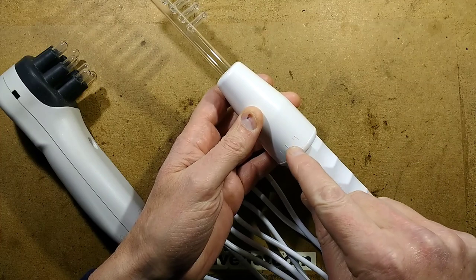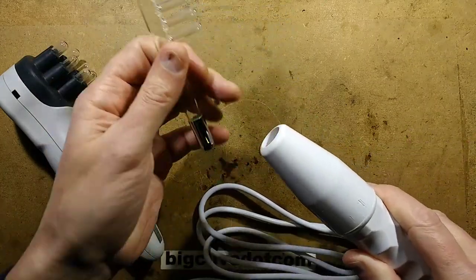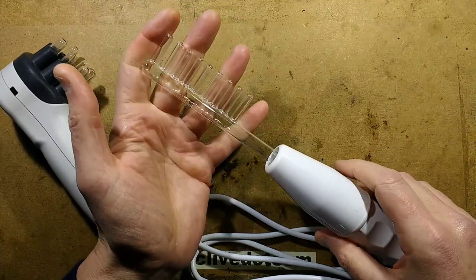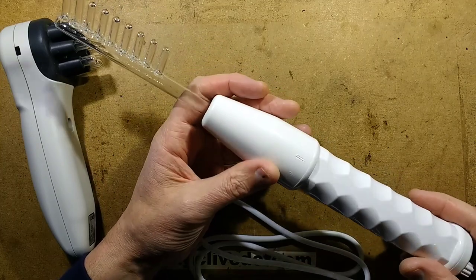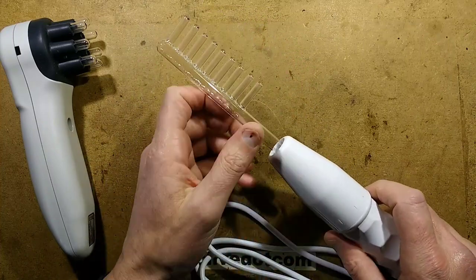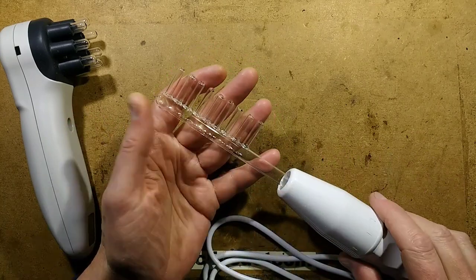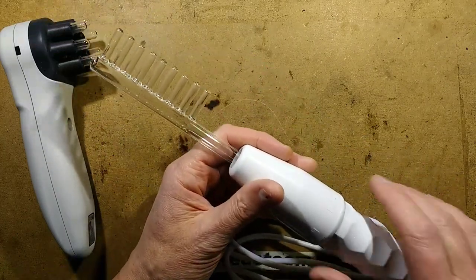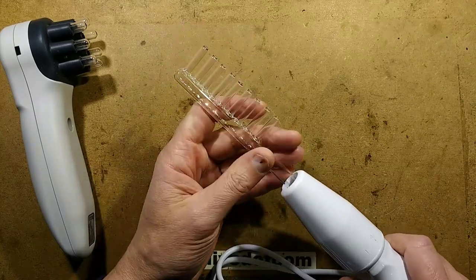This is one I took apart in an earlier video - you can see all the chew marks around it where it wasn't supposed to open. This thing is very reminiscent of the original violet wands but a more modern electronic version. What it does is it puts out a high voltage, high frequency by plucking a high voltage transformer. The original units had a metal rod you put down the end for enhanced effect. This model does not come with it, and I don't recommend using the metal rods in them. A lot of people have these as scientific curiosities and don't realize that in some of them the metal rod when inserted is referenced to the mains. I can't use this one at the bench because I've got electronic components all around and this thing creates a massive electrical field - it is basically a high voltage RF transmitter.